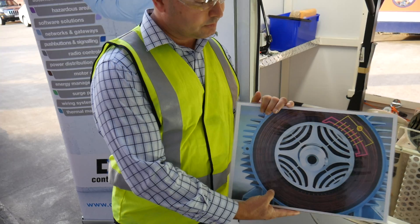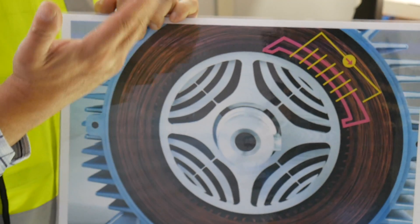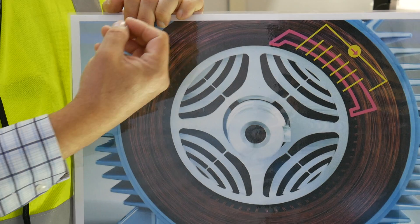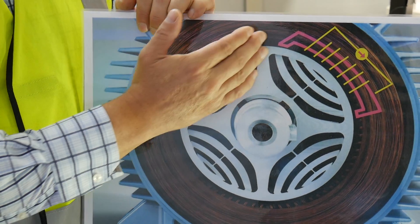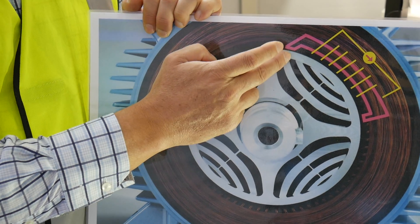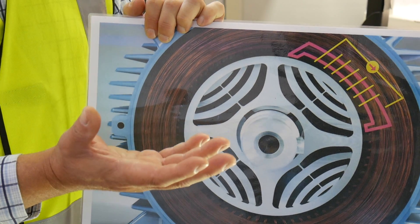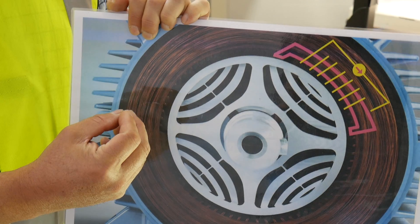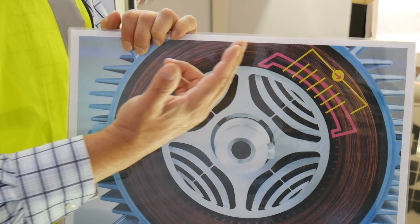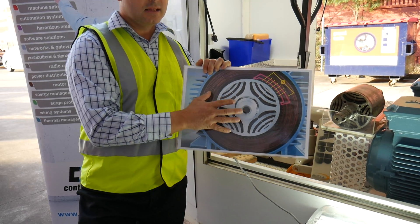Looking at this illustration of the rotor, you can see a simple magnet — this will be the north and this the south. If we sprinkled iron filings on this sheet, you would see them draw the natural flux lines. The rotor is designed to have minimum reluctance across these parts, and by minimizing the air gaps we also minimize reluctance. We want to minimize reluctance in order to increase the flux and induced energy into the rotor — that is where the efficiencies come from.